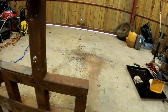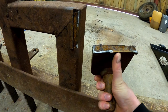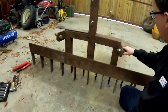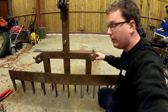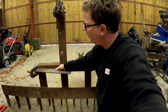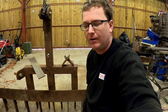I'll show you the welds that were on it. You can see the welds didn't penetrate down here — they didn't penetrate the metal. The other ones were alright. What I'm going to do is reattach them in the original position, cut away all the old material, clean it all up and do a good job. I've come across some plate, so I'm going to gusset it in the corner to try and spread the load and make it a little bit stronger. I'll clean everything up and bring you back then.